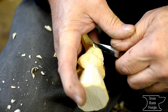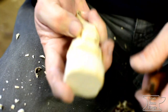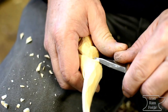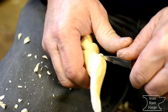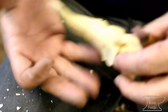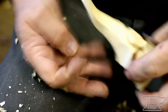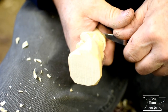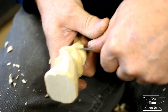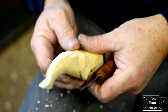You've got to be careful when you're near an edge like that, because you could chip that hat out if you push too hard. So you kind of want to keep your pushing to a minimum. Make sure you're cutting and not forcing. Sometimes it's okay to kind of split the wood out, but in a little area like that that's pretty delicate, you want to be moving pretty carefully.